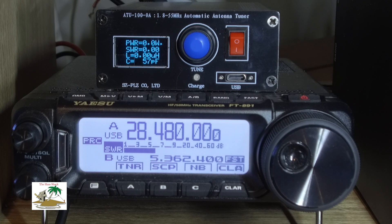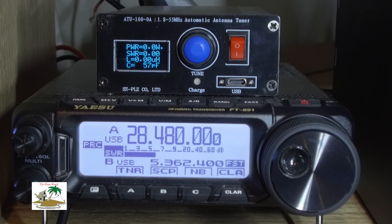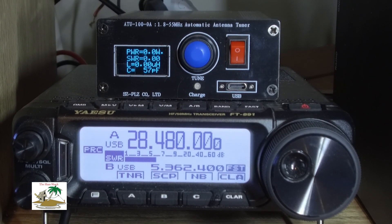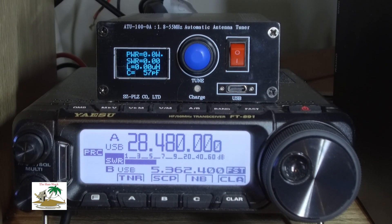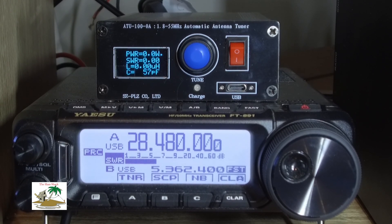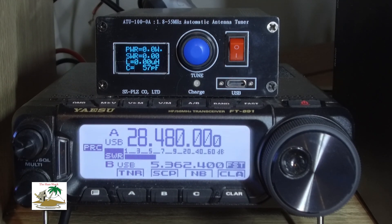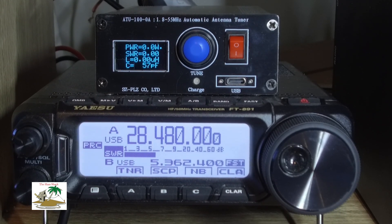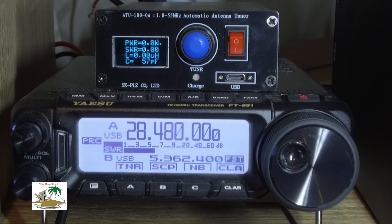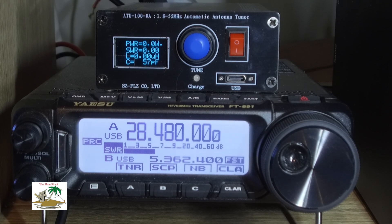On 160 meters I did try to tune, but the antenna is not designed for that and the best it'll get is an SWR of 4, which doesn't work for me. But the 3:1 SWR limit is no worse than my ICOM 7300, and this tuner actually tunes more than the ICOM 7300 does. The ICOM 7300 often just cuts out — it removes the tuner option because the SWR is too high — and this just works.